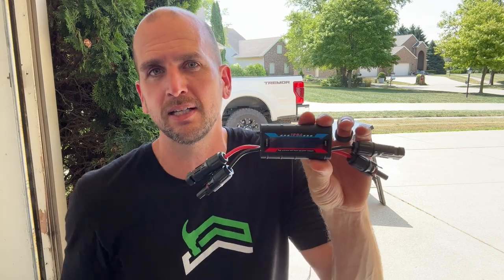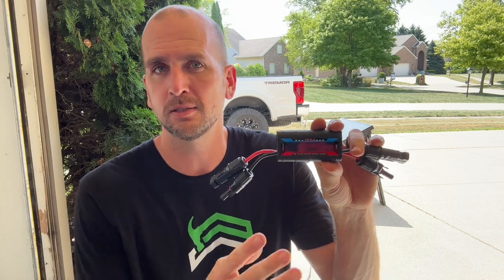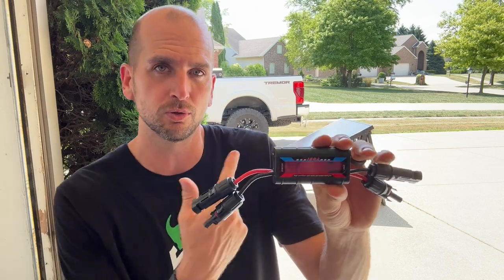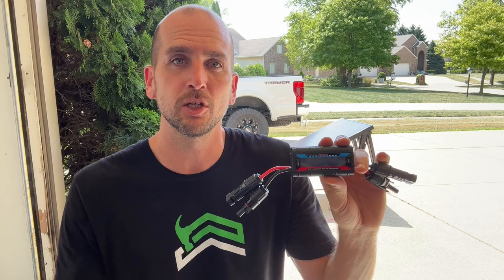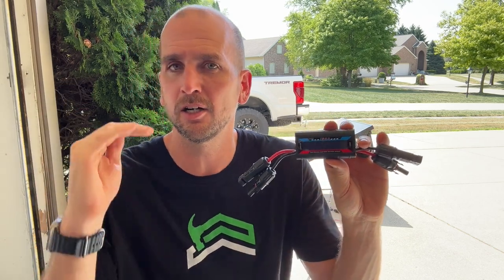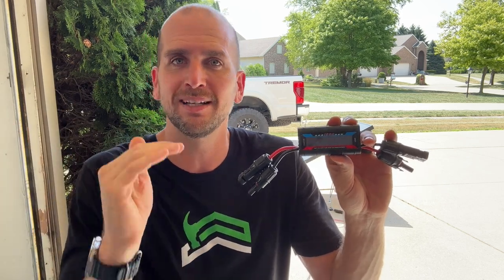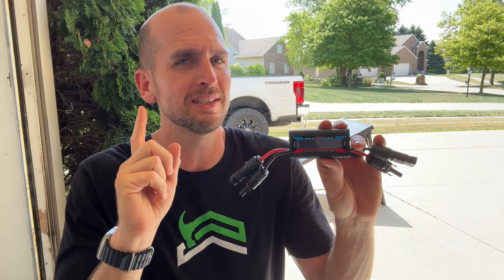The better solution is available on Amazon for about $13 to $15 — a simple power analyzer. These are used for RC cars, drones, car battery analysis, but they're also great for solar panels. You'll see a link in the description to this exact unit. It maxes out at 150 amps, which is well above what I need, but it maxes out at 100 volts, which is technically a little shy of what I can bring into the EcoFlow Delta Pro I'm testing right now.